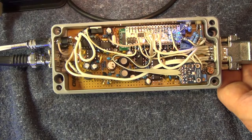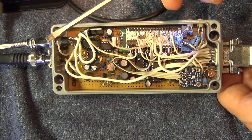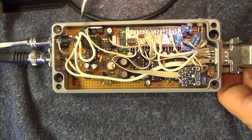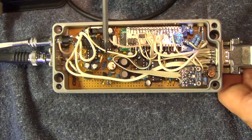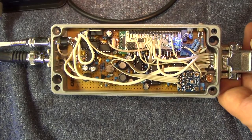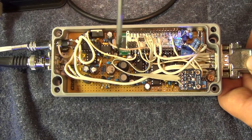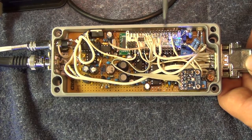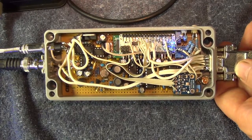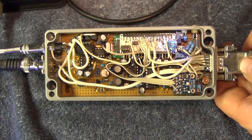This one amplifies by 100,000. And so I convert the frequency to a voltage, and then decide over this capacitor here, down here, if a 1 or a 0 was sent. And this goes out over this cable here to the Arduino. I tried this directly on the Raspberry Pi, but the Raspberry Pi is just not real-time capable enough.